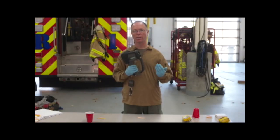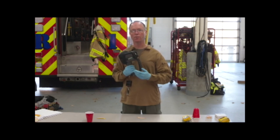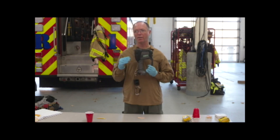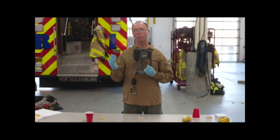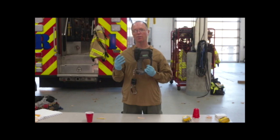Additionally, if I see a closed container in a chemistry lab or industrial process without a pressure relief valve and that container is getting warmer — say as you approach, the floor is at ambient 68°F and the container is at 112°F — and if you continue watching and the temperature is increasing, 120, 130 degrees, you have no idea at what temperature the corresponding pressure will cause that container to fail violently. So at any point in time, if you have a closed container that is increasing in temperature, you shall immediately withdraw so that you are not involved in a violent failure and subjected to fragmentation of that container.